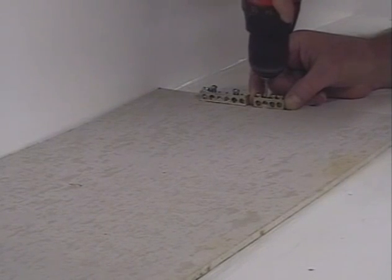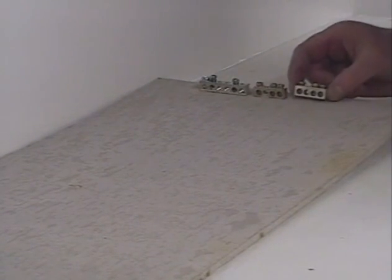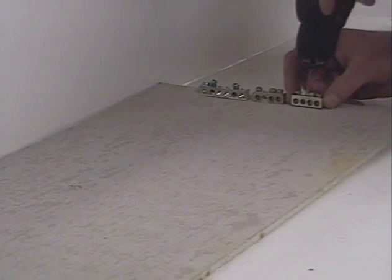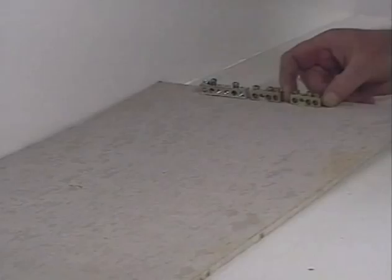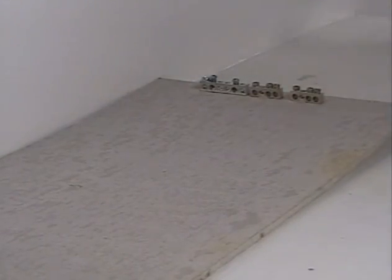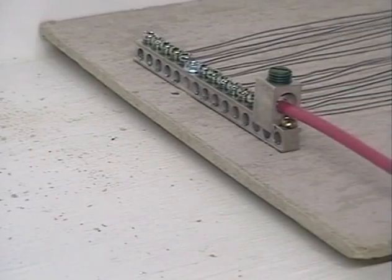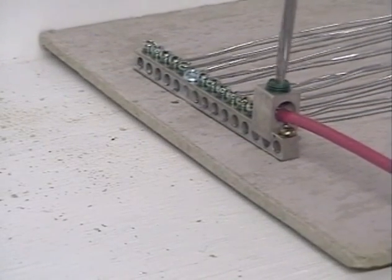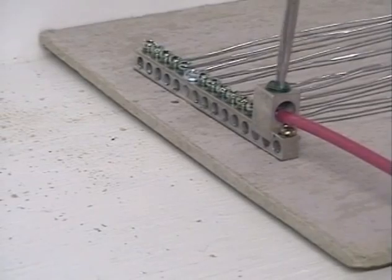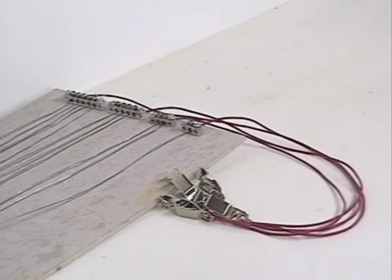For a power controller, we've selected 18 gauge wire. You need to cut up the wire to about 36 inches long so you have enough extra to clamp into the bars. Space all the smaller bars about half an inch apart. Heavier wire should be attached to the common bar as all the power will be drawn through it. The right-hand smaller bars may use lighter wires with alligator clips attached, so you may easily connect to the bus bars.